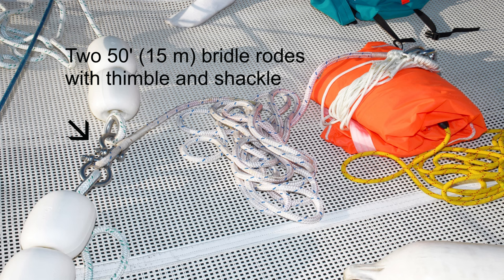So you shackled them — no chafing at all. What I did was I unscrewed the eyes, leaned over, and put the bridle right in there — the bridle that's got the stainless steel thimble. You have a shackle right to the thimble. When we bought our para-anchor, it came with the shackle and the thimbles — the bridle. It was plug-and-play, a fixed bridle, probably close to 50 feet if I recall — close to the length of the boat. That's usually how we normally set that up.